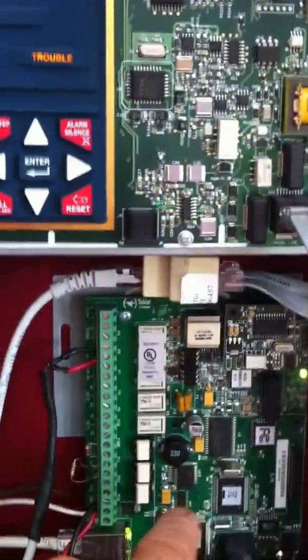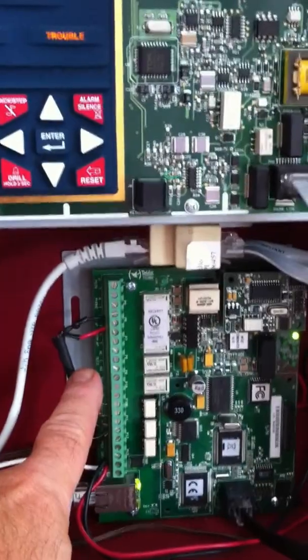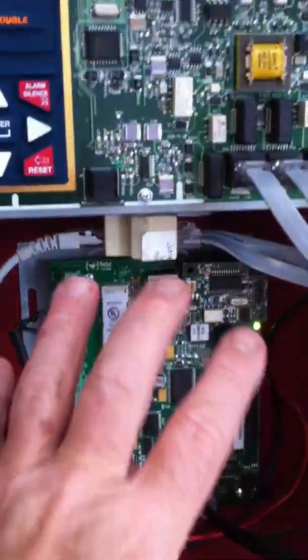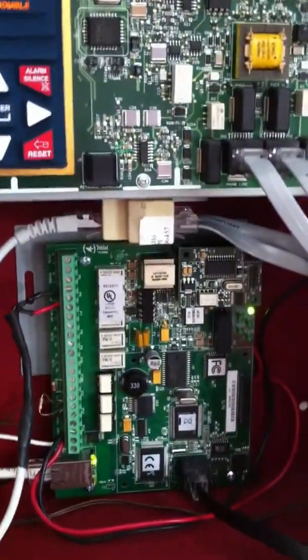There's plenty of room to mount the unit in the cabinet. This is the latest model and you'll notice that there are two clips here, and behind the unit there's a metal bracket. You can order this part called IPBRKT from Honeywell — the unit screws to that — and then there's also a cover plate, which is a plastic cover with all the terminal designations shown on it.